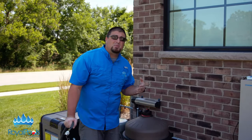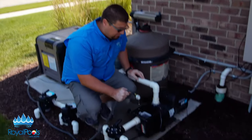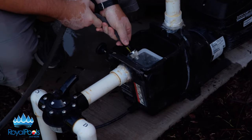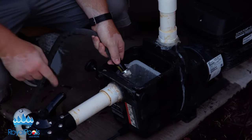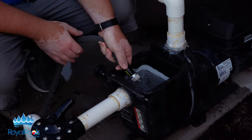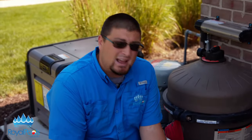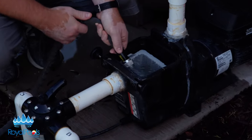In case you can't get it primed back up, what you're going to want to do is grab your garden hose. Assuming this is either dry or it's just not pulling the water from the swimming pool, you're going to want to prime the pump with water manually. You're basically going to fill it up with water, letting it flow into the pipes here — it needs some draw from the pool, so we're going to force feed it the water that it needs. Plumbing underground has ridges, hills, or elbows that are restricting flow, so we're just going to help the pump a little bit and give it some water. You're going to want to give it 30 seconds to a minute.